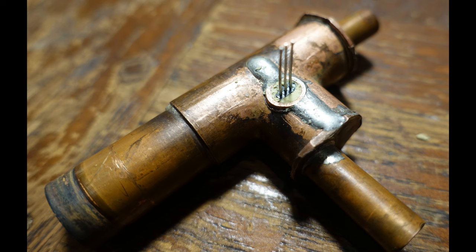I have used one as a sole bottom temperature sensor for controlling the 35mm column. I was not able to achieve over 96% proof, but I was able to achieve over 95% consistently with the bottoms of under 0.2% and a fine tasting product. So despite my reservations, I would certainly recommend it as a place to start with bottom temperature control of larger diameter columns.